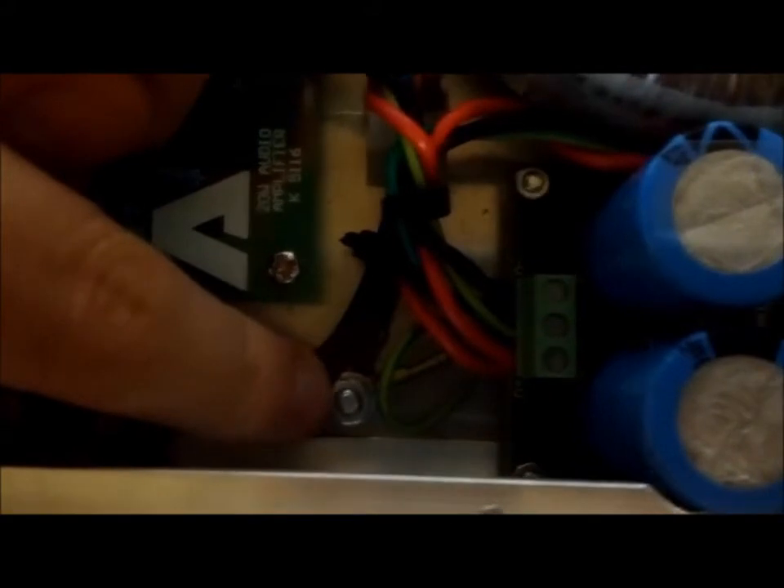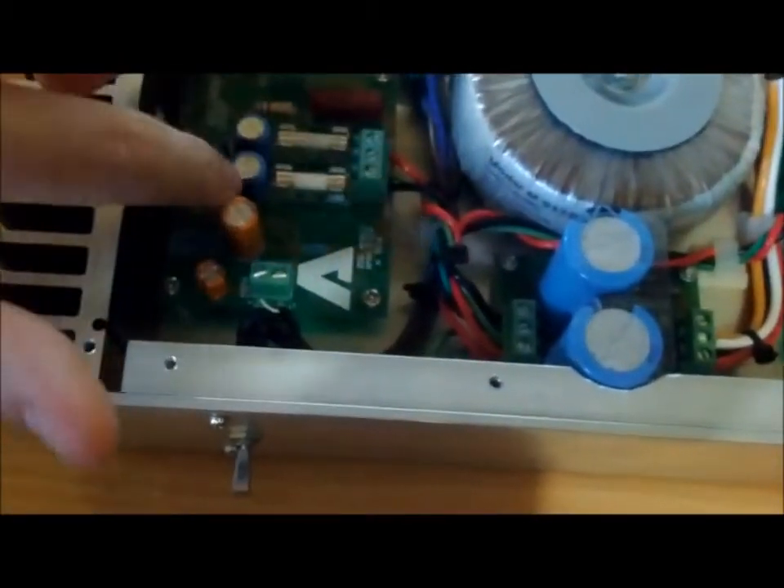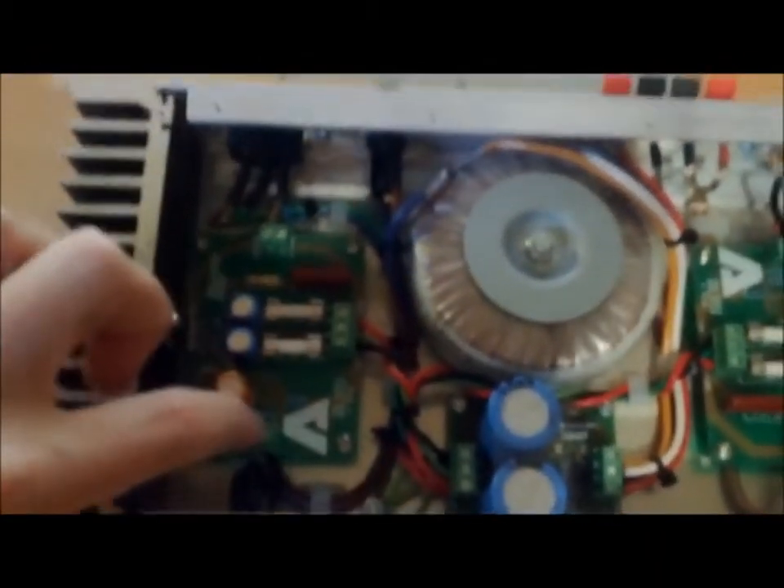It's an internal look at it. The wires in here are twisted together, as you can see — minimal interference. They're all grounded to that star point just in there. That's the ground point there — that's all your proper arrangements with that. And then up to that point there, which is just a star ground, it then goes out to each of the modules, and from there the audio input is grounded.